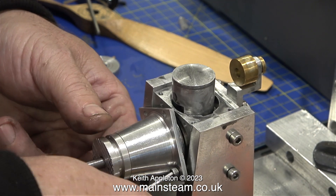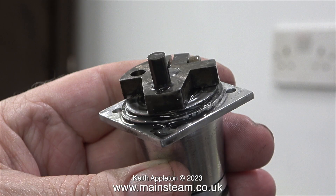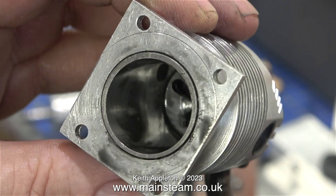In a very short while the front of the engine was withdrawn, revealing the crank web on the crankshaft. The construction is very strange. I have a comprehensive collection of model aero engines, most bought from John Mills of the Double Boost YouTube channel, and none of the crankshafts and crank webs are made like this. On all the engines I have, the crankshaft and crank web are machined from the same piece of metal. Maybe this is part of the problem. The cylinder liner is absolutely beautifully made — as smooth as silk.